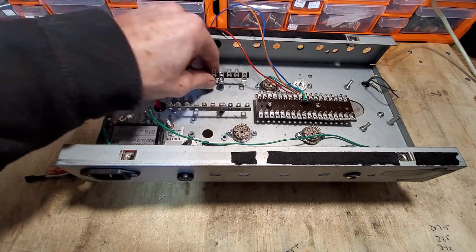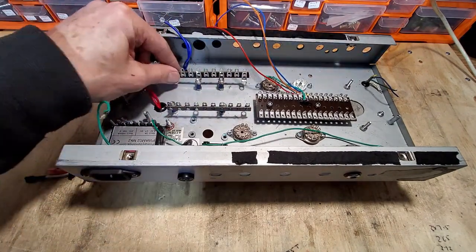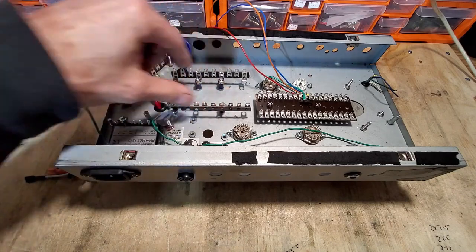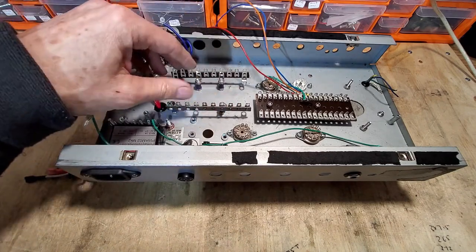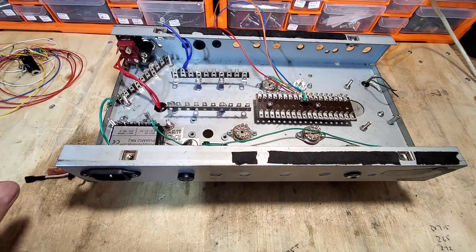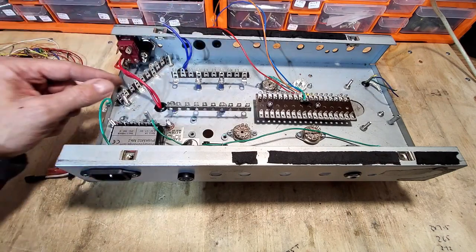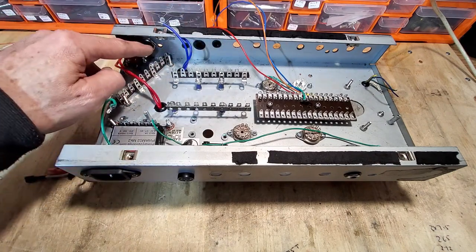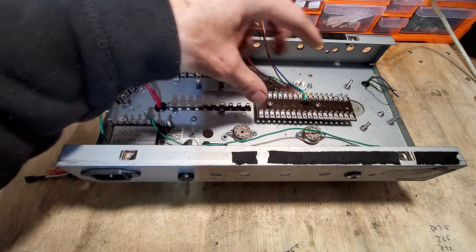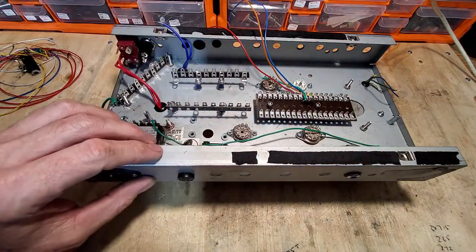I've installed these really well. They're not quite straight, but if you blink quick, you won't notice. Those are for the capacitors and whatnot, electrolytics, cathode bypass resistors, whatever. We've got this for the preamp section here, and then I've got one across here, because this one we're going to use for the heaters for the tubes. We've got a pilot light in there, a nice chunky main switch, and four valve seats. That one's a different seat because it's got a screen shield on it.